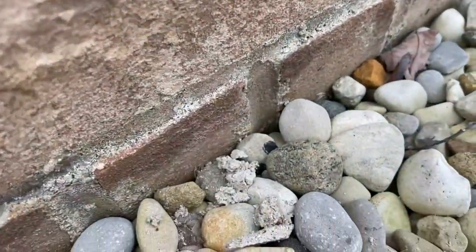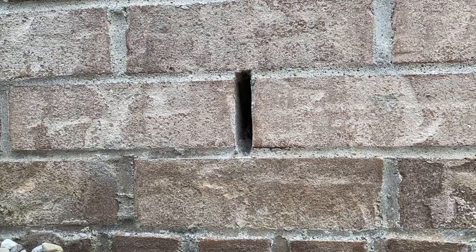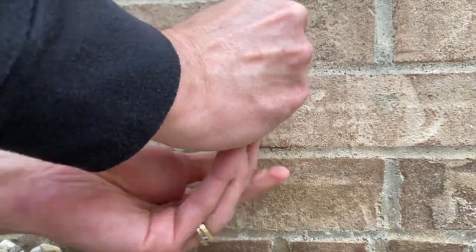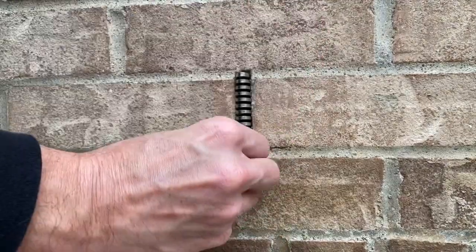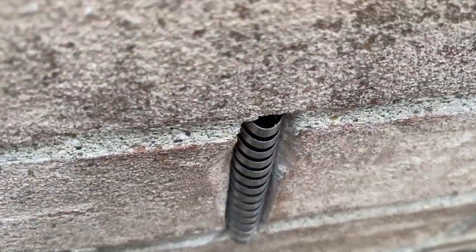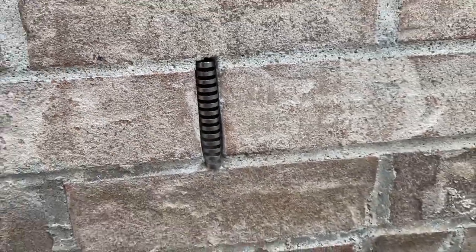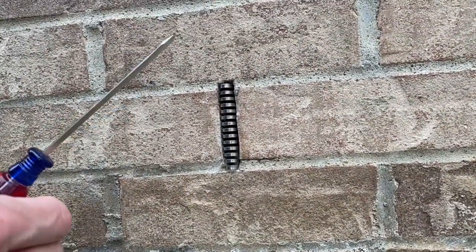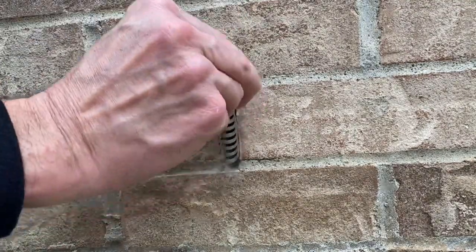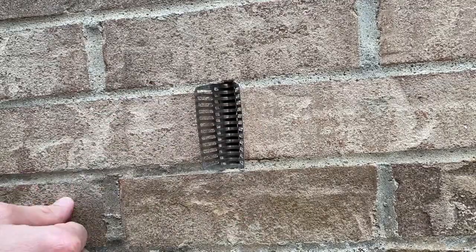Much better. As you can see, a lot of mortar came out — big chunks. I want to show you two things: I'm going to install a screen into that hole, and I also want to show you how to remove it in the event that you want to pull it back out. Take that flathead screwdriver, carefully come in from the top and go down as shown there. It comes out very easy. Now, in the event that you slid it in the opposite way, it would not come out as easily. So make sure you install these properly.